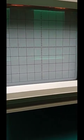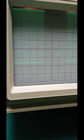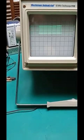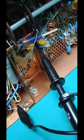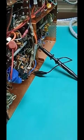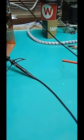And again, this is all necessary because I changed the bias on these tubes. I put extra voltage drop in the plates. And I've adjusted the 10 meter, but weak signal, the one tuning shaft is tuned partway in, the one for 10 meters in the back is screwed almost all the way out, and that's probably not going to work on transmit. On 10 meters, it's mandatory to align it on transmit. And I made a mistake, I forgot to take the alignment load off. So guess what? I get to do it over.